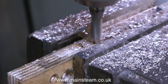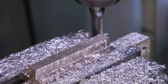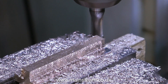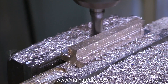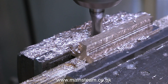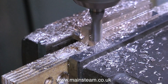That can be okay on a larger engine, but on an engine of this size I'll probably just fit a removable cap. As you can see, the milling operation is well underway and it's looking a bit rough down the middle — that's because I'm taking rough cuts. I'm going far too fast; the final cuts will be much slower and I'll get a good finish in the vertical plane. When I say I'm going too fast, I don't mean this fast — the video is currently speeded up considerably.